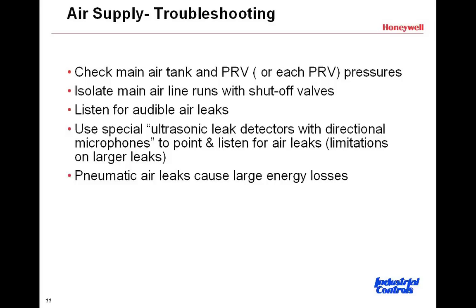If you find that pressure is low at an air handling unit, go back to the equipment room and check the regulator — is the pressure within spec there? If it is, there's probably a leak somewhere between the regulator and the air handling unit, and it becomes a logical process to isolate where that problem might be. Air makes a good deal of noise when it leaks, at least for a larger leak, so you can use your intuition to listen for it. If pressure at the regulator is low, ask whether the regulator is mis-set, and check whether the air on the line side or tank side is where it should be — that might point to an issue with the compressor itself. Perhaps there's a drain hanging open. Anything preventing the system from maintaining pressure is a point of concern.